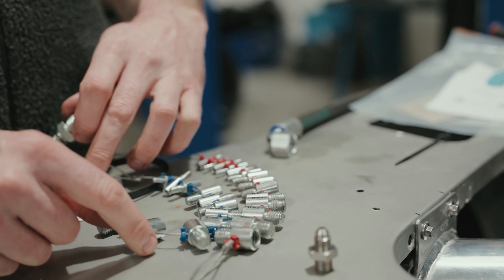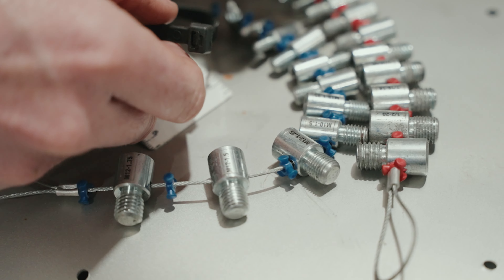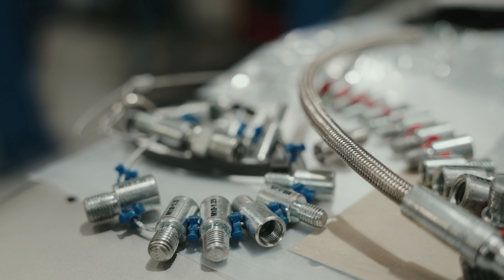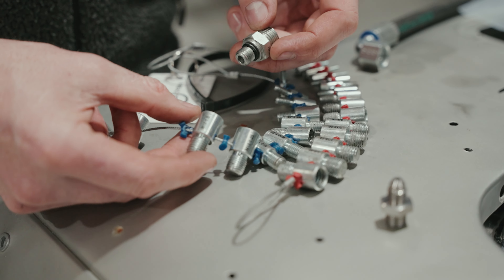This is a great tip: these thread detectives come on a little wire lanyard and we keep them in our tap drawer. They're not a lot of money. As you can see, you can go along and figure this out — even if you were blind you could feel it, though you'd have to ask someone to interpret the reading of what your thread is.